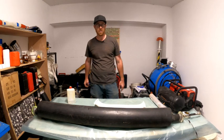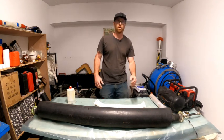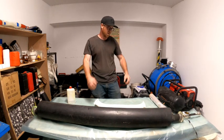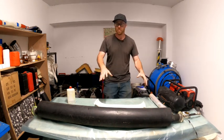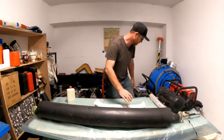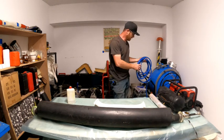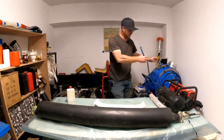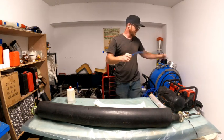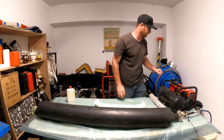Especially on a cold day, you should exercise your packer beforehand — especially for a transitional repair like this. I want to inflate the packer in the larger diameter pipe, so we're going to put it in a six-inch pipe, inflate it, and keep it inflated for a little while during our preparation work. That's going to give it some memory, so when we go from four to six it will properly inflate in that six-inch pipe for the best results.